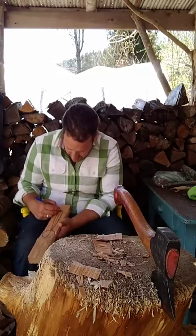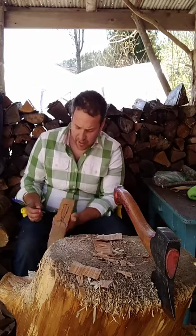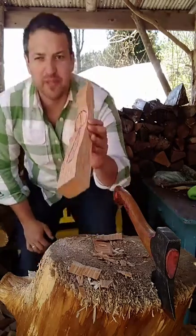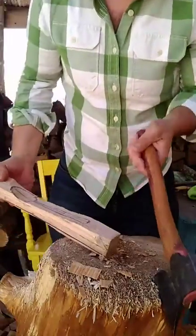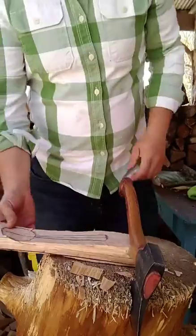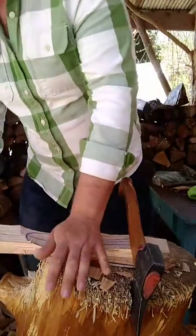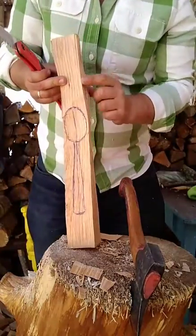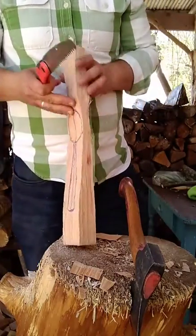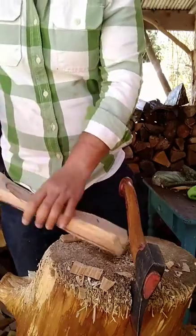But yeah, that also saves a tremendous amount of time, not having to true up these sides, which ultimately are just going to get cut and split away. Hi, Daniel. So not truing up the billet, particularly since I like to have that extra bit to keep my hand safe, truing up that is just completely wasted effort.